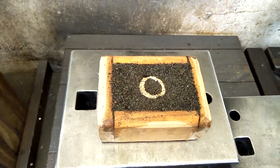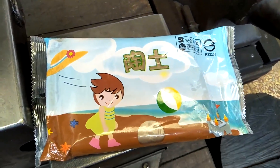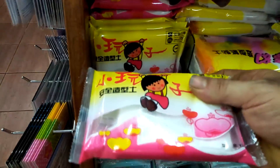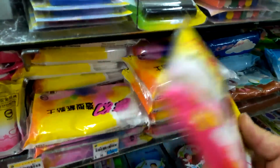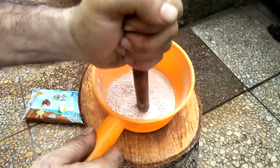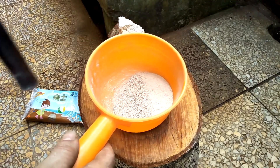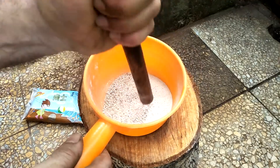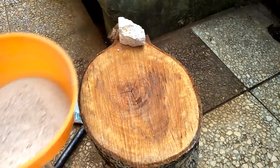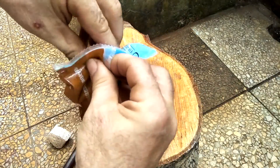I still want to cast this ring as a trial run, so I went and got some ceramic clay at an arts and crafts store. I picked up one or two types. I don't know why I seem obsessed with using crushed-up fire brick in every mixture, but it just feels like something I should do. This time I'm really grinding it into a fine powder, as per one commenter's recommendation, and then I'll add that to the ceramic clay.